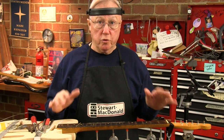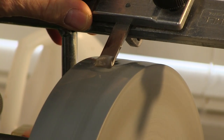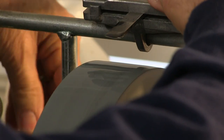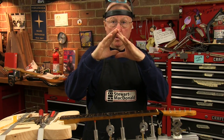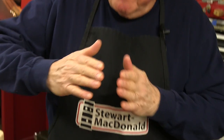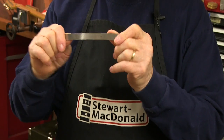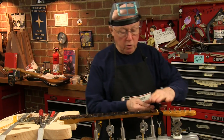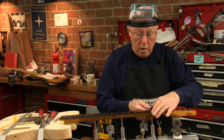The first thing you do is sharpen your chisel — even the best chisels don't stay sharp forever. I'll be cutting a V-shaped wedge in the fretboard so that my inlay follows the grain of the wood. To do that I'm going to grind a V-shape in this feeler gauge. That will be a template I'll use to cut with a razor knife and a chisel and get a clean line.